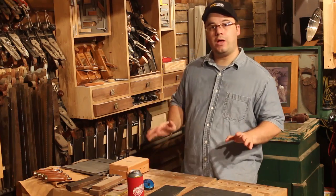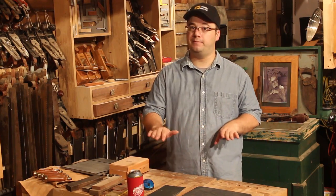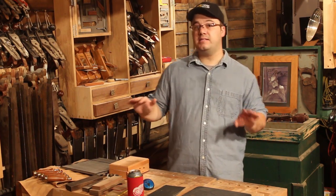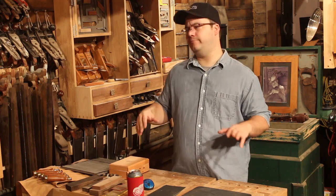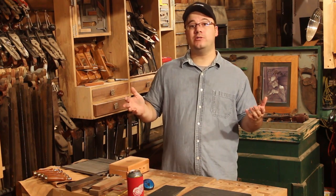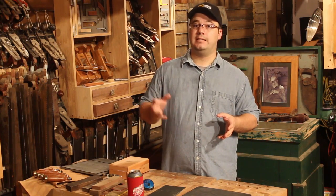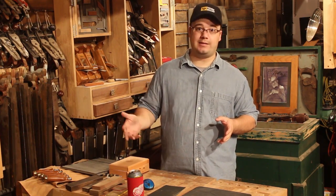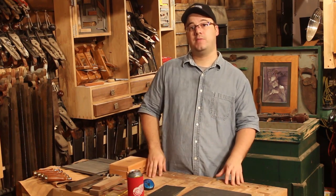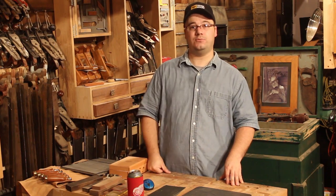But the most useful are the flat surfaces I attach my sandpaper to for sharpening. Some people use precision machined lapping plates. They insist on absolute flatness to the billionth of an inch. I look at it this way. Old-timey woodworkers use stones, right? And those stones wear. In time, they have to be reflattened. So you take that stone and rub it against another stone or something else. Some actually use the sidewalk outside the shop to flatten their stones.